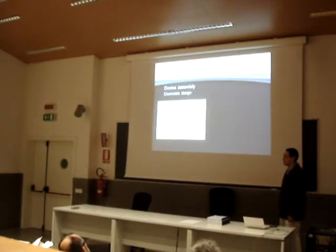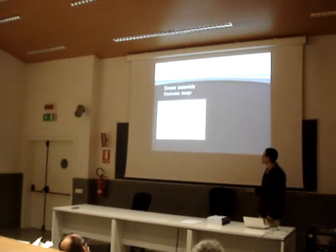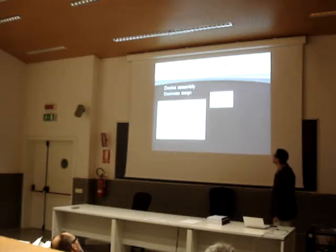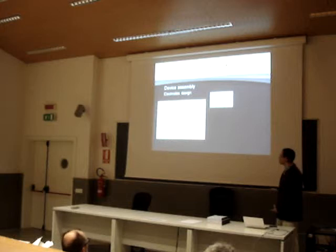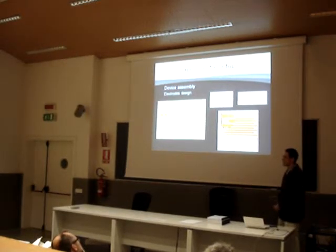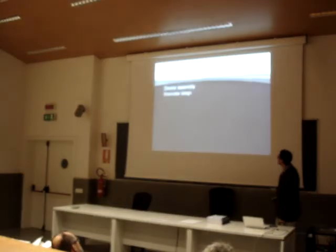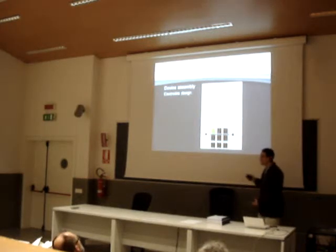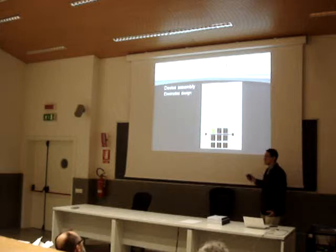So for the electrode designs, I have been doing research, and there are different configurations of the electrodes, from the rotation of particles to the accumulation of particles, like electrophoresis. The most similar to our purposes is this one. So what I have done is I made different measurements of the electrodes, and I made a table where I have 3 cases with different measurements of the electrodes and a fixed length of the electrode. This electrode is going to be inside a cell. So I have 6 cells on the top that are active and 3 that are not connected, and that's a reference.